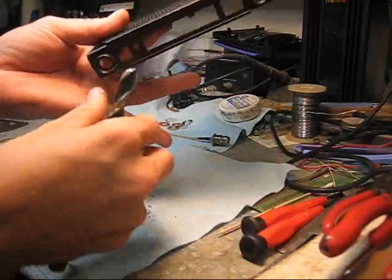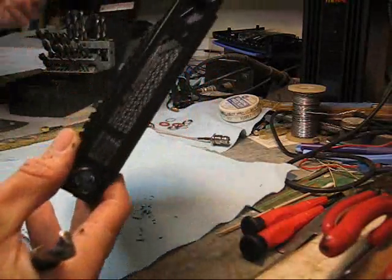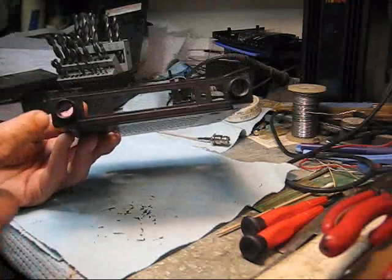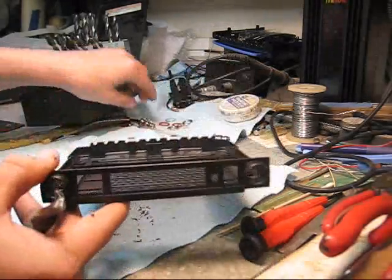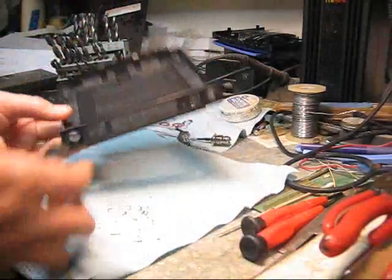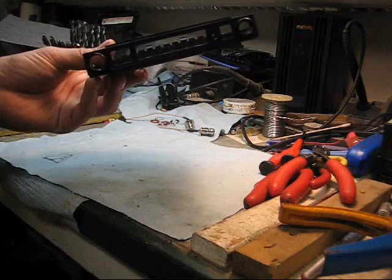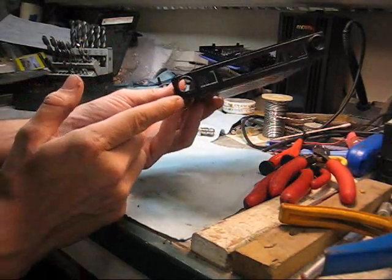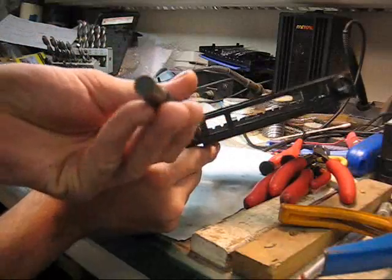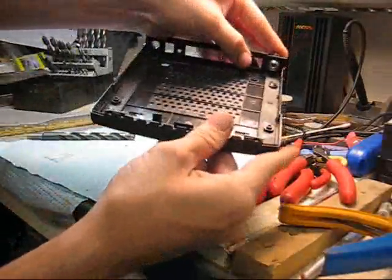I've got some material removed and I think it's enough for this size. If you think it's too big, always do a step down — you can always do that option. If you have a Dremel tool, you can get in there and do it that way — whatever you have to do to make this connector fit inside there, it's just up to you how you want to do it. I've almost completed this left side here with the half-inch drill bit, and it successfully went through and will now accept our adapters, which will slide straight through there.